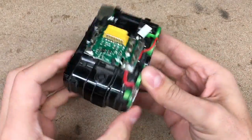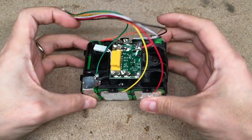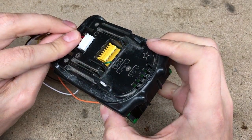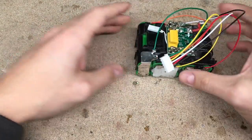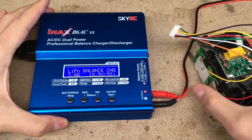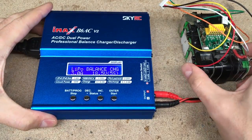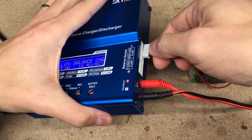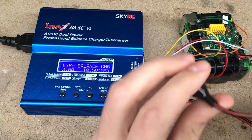In case you don't want to buy a replacement circuit, or be dependent on the Makita regular charger, or maybe your charger is broken, there is another charging option. All you need is to solder lithium battery balance wires between each cell group and find a good place for a connector on the battery housing. This setup will allow you to charge and balance the battery with a universal smart charger. Plus, you will be able to see the state of each cell group connected in series by looking at internal resistance and voltages. I want to note that internal resistance is only readable on the IMAX B6 V2 model — I'll leave a link in the description where you could get one.